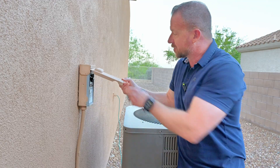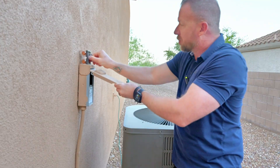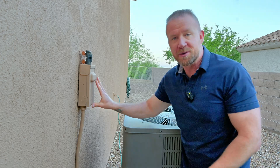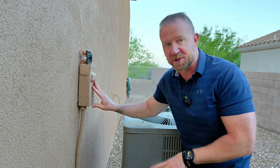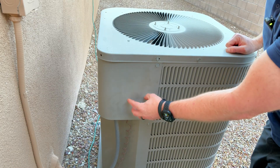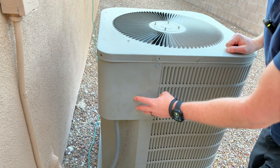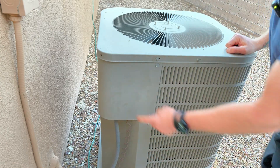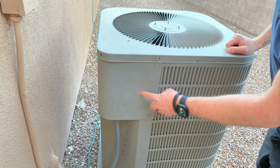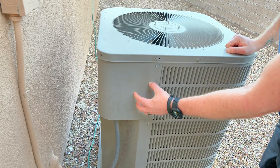For mine, I'll just open the cover and simply pull out the fuse. I'll place it right there so I know where it's at at the end. I've closed the box just so we have no exposed circuitry. The next step is to remove the cover panel and expose your capacitor and start relay. Every air conditioner will be slightly different — just look for where your electrical runs in; that will be where you'll locate your capacitor and relay. We'll go ahead and take off these four screws that hold on the cover.